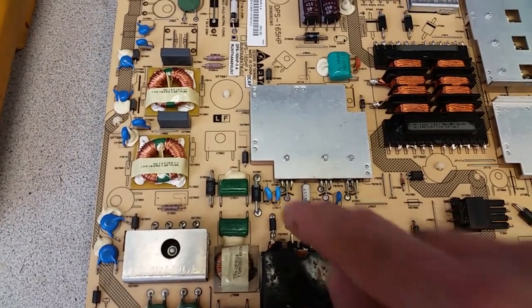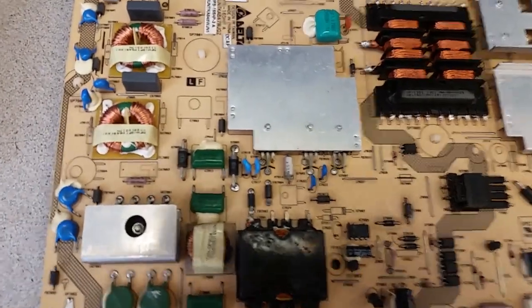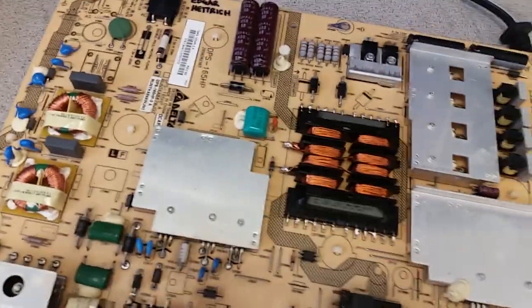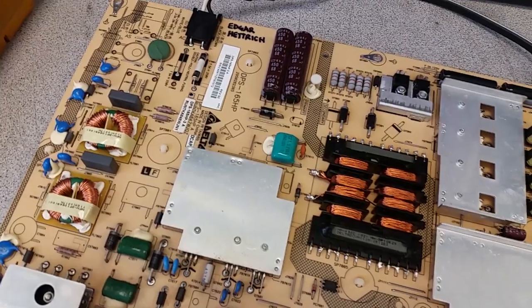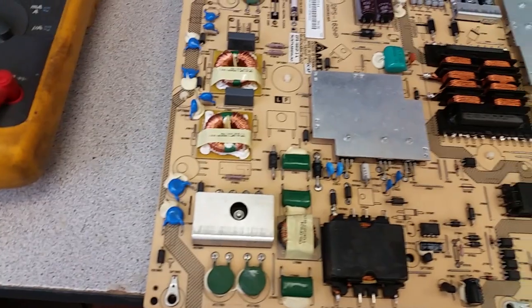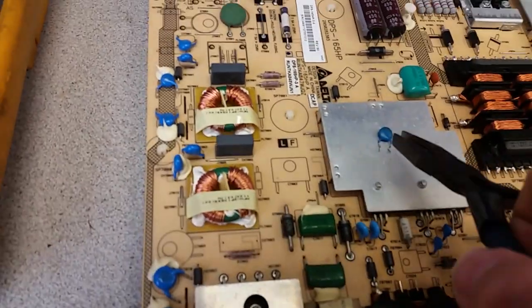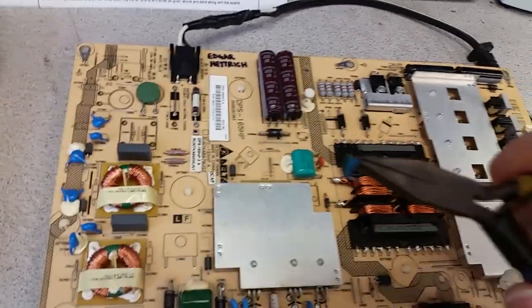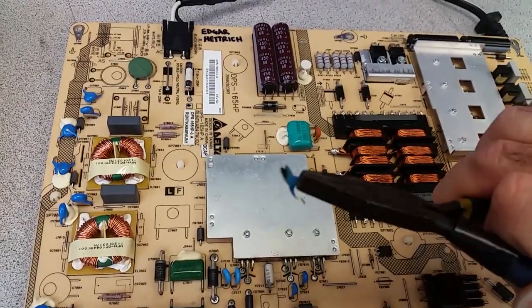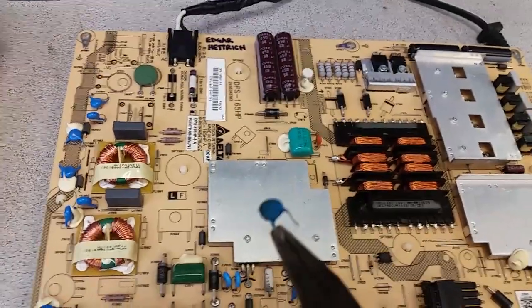The main fuse was blown. The capacitors for discharging the switching transistors on the PFC circuit were blown open. I actually have them nearby me in the trash. This is how they looked. This is a live board, so I'm careful as to what I do, but basically this is how it looked, totally blown.